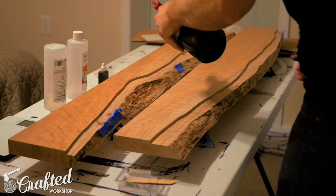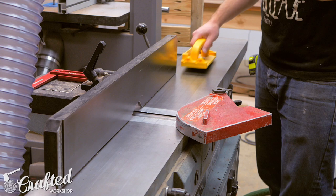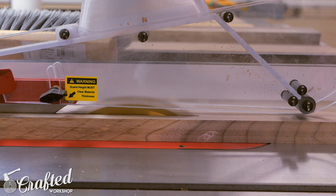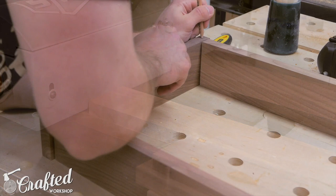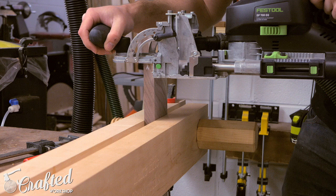While the epoxy cured, I started working on the table legs. The legs are really simple — just rectangles made of three-quarter inch by three-inch wide walnut. I used rough walnut I already had on hand, but you could buy S4S lumber if you don't have the equipment to mill the wood yourself. I used the jointer, planer, and table saw to bring the pieces to their final sizes, then sanded all pieces up to 220 on the drum sander. To assemble the legs, I used my Festool Domino XL, but there are many ways to assemble butt joints — pocket screws, dowel joinery, biscuits, or regular screws. Dominoes are extremely strong and fast, so that's what I went with. I used 8mm by 50mm dominoes with two in each corner.